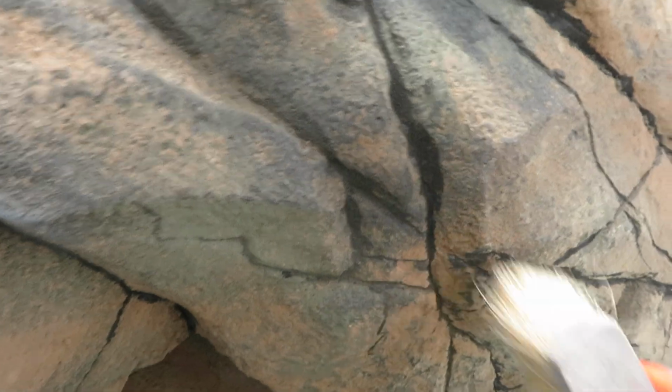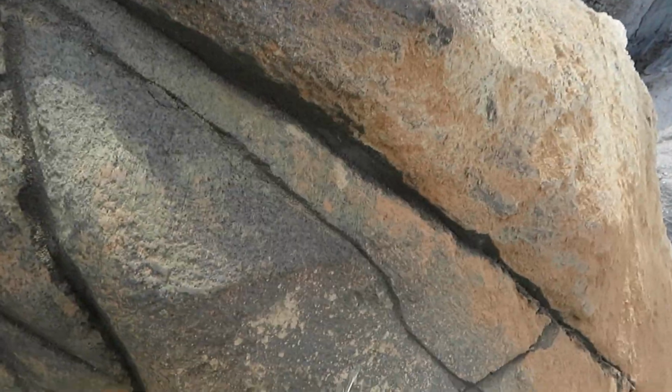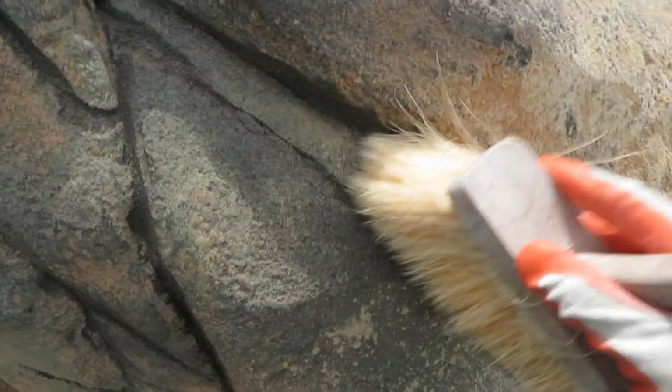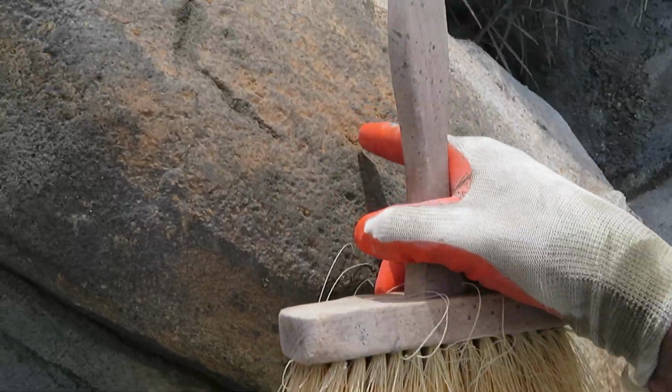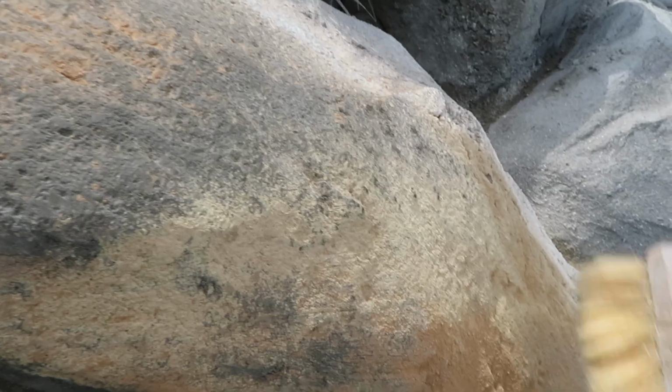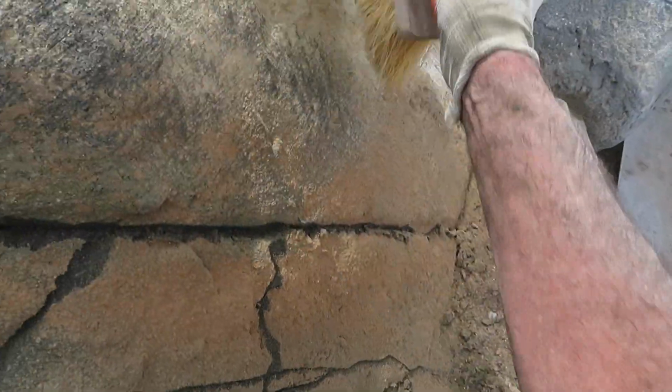The brushing is so simple and does such a great job of antiquing what you're doing. It's just the coolest thing. You can see some streaking of the bristles, so I come back and stipple a little bit. And again, the fog coat, that cementitious stucco product, stays in some of the spray pattern dimples, if you will, and just gives you a really wonderful natural look.